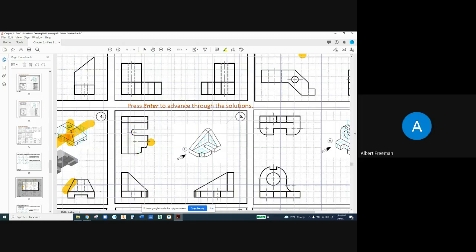In the top view, the arc is disconnected from any other identifier. But let's say this is a radius of two — I know the center will be two up from this side and two in from this side because it's on a quadrant. For a quarter round of a regular circle, it would be on the east and south quadrant. If the radius is two, I'd come in to the left two and up from the bottom two — that would be my center. The only reason we put center marks is to try and locate something.